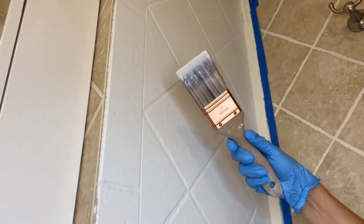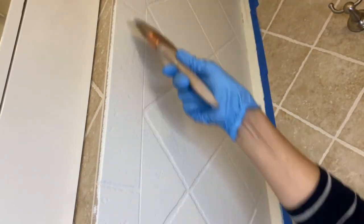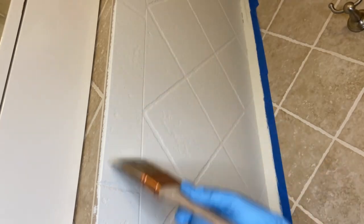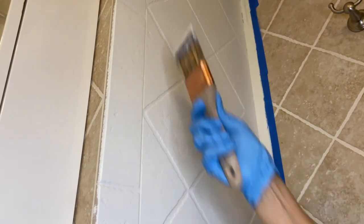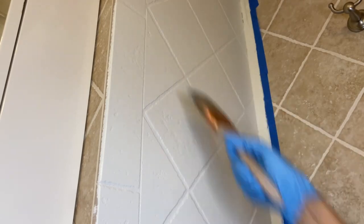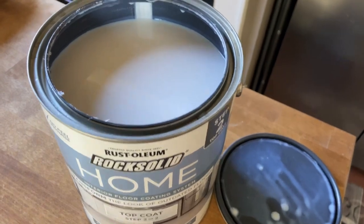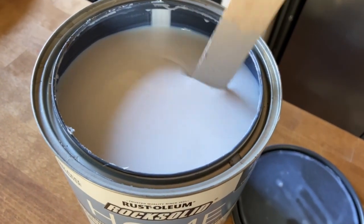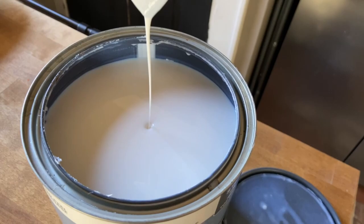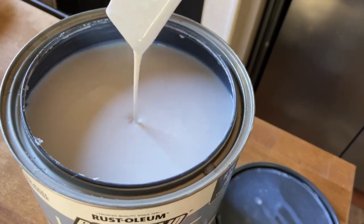After the second coat I let the paint dry completely overnight, and the next day I came back with my Rustoleum top coat. I'm using a synthetic brush as per the recommendation of the customer service rep — she said it was possible to use on vertical surfaces as long as I use a nice synthetic brush and apply a very thin layer. You don't want to use too much, as this product is very runny and can easily leave drip lines.